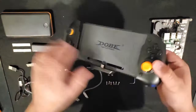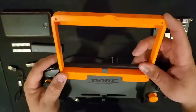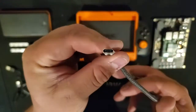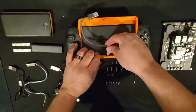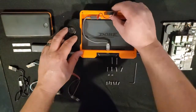For the first part of this build we're going to start with the controller and the 3D printed chassis, which we're going to slide in — it should slide in easy. After which we're going to attach the female USB cable that's going to allow us to connect the controller to the Pi. Make sure it's oriented so that it's going to connect easy because it's tight in there.